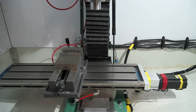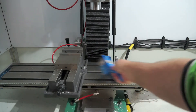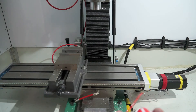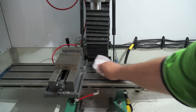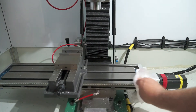The next thing we need to do is get a clean rag and wipe the table down. I would prefer you sweep it first and then wipe it. It's okay if the chips are down in the well — they're out of the way. I'm going to spray mine with a little bit of WD-40 or CRC, which will allow me to pick up any dust or debris easier and maybe move a little bit of surface rust.